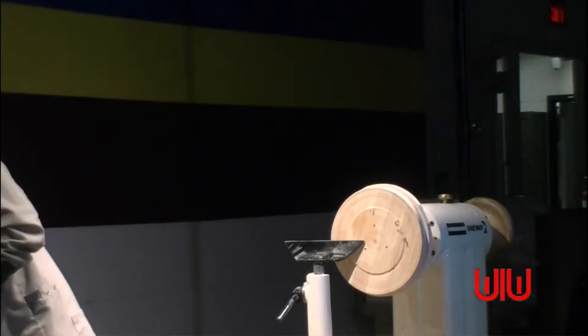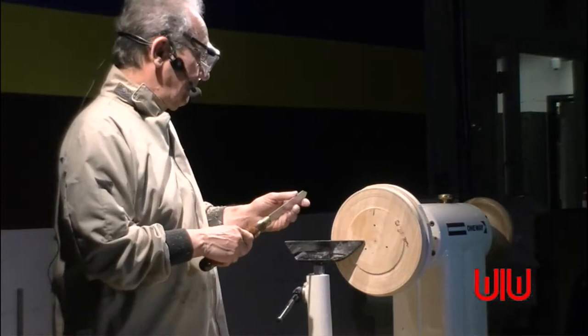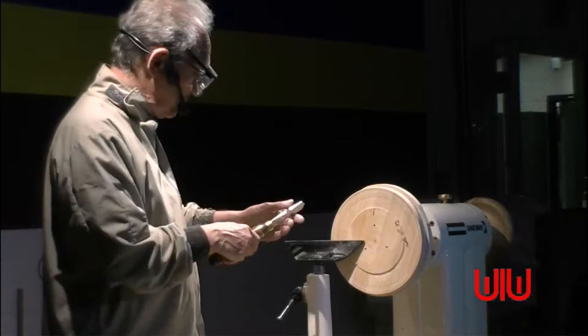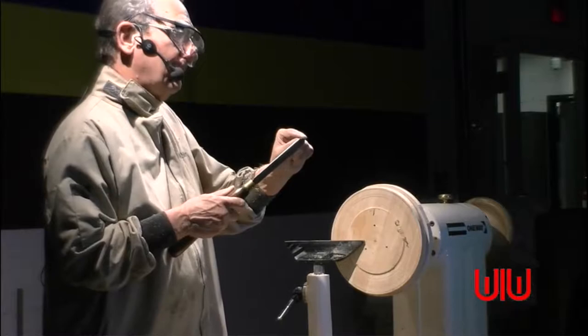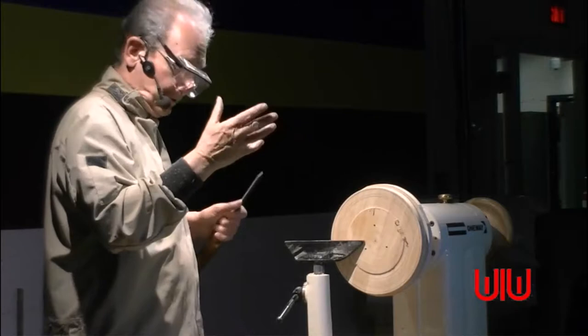You do not start it with a parting tool, like a parting cut? You can use a parting tool. You can actually do the whole thing with a parting tool, but the trouble is, on the outer edge, as the parting tool goes in, the edge of the groove starts to rub on the wings here and moves the tool away. So you go down, and it's not parallel or perpendicular, you go off at an angle. You can fix that later if you do it. So let me just start off with this then.